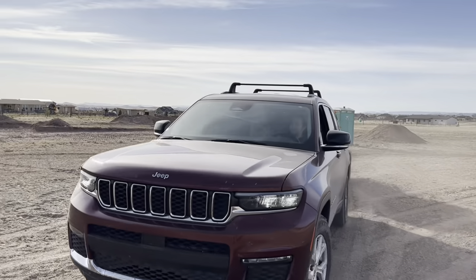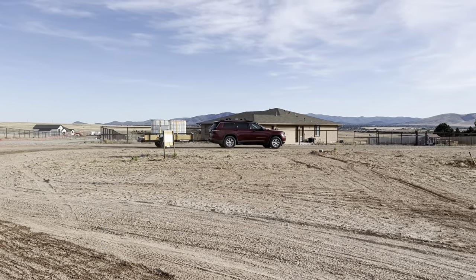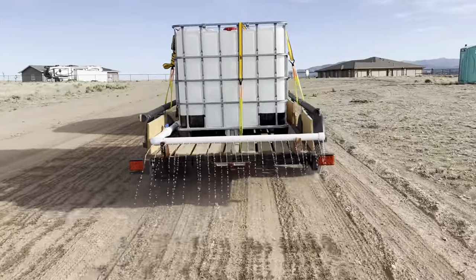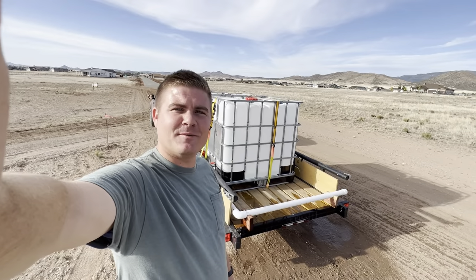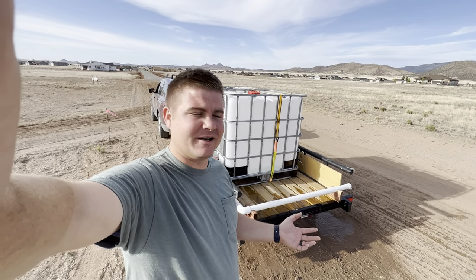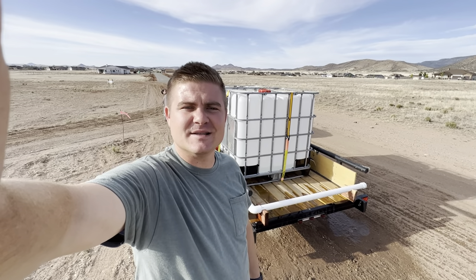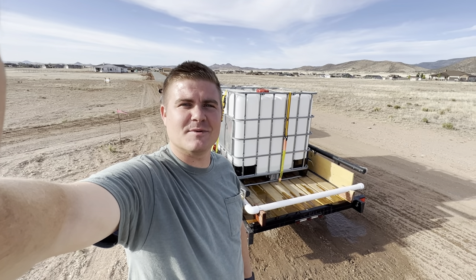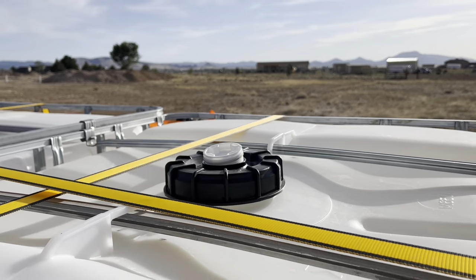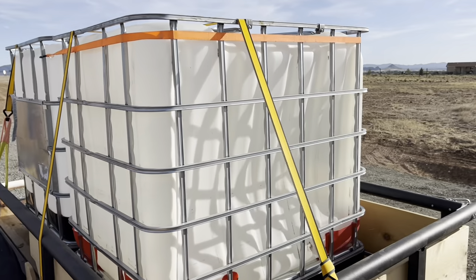It leaves a pretty good trail of water, and with a couple passes everything's completely covered and should be much more suitable for compaction. The homemade water trailer works great for what we needed — just a small job, not quite worth hiring a water truck, and easy enough to put together. It should supply enough water to get this wet enough to compact well and get it ready for the gravel. One last thing: don't forget to take at least the light center cap out, otherwise you'll end up sucking in your tank because there's no way for air to get in.